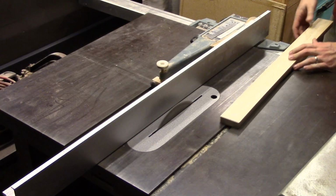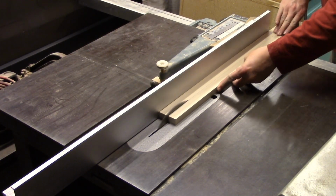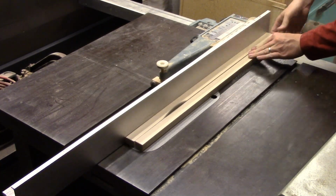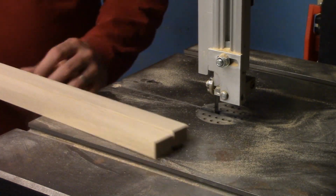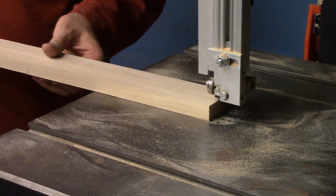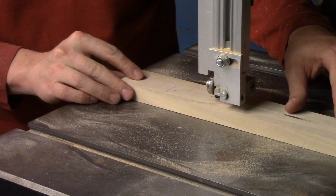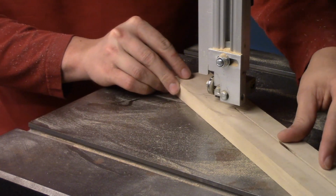So I just cut down one of those pieces to make the side support for the side table. And this is going to be a stop cut because I need to make a curved cut at the end because I need as much meat as I can for the pocket holes, but I need the majority of it skinny in order to fit the planer underneath the side table.